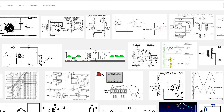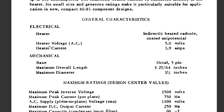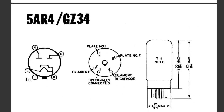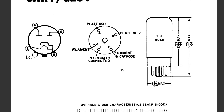Tubes and diodes are very similar — more specifically, rectifying tubes are very similar to two diodes. If you look at the spec sheet of the GZ34, you can see that the heater voltage on the filament requires about five volts. Right here you can see the max input voltage and then the DC output. Usually the two plates have a full AC signal applied, and then on pin eight you'll have a close-to-DC signal coming out after it goes through a capacitor and a choke. I'll show more detail on this in the next video.